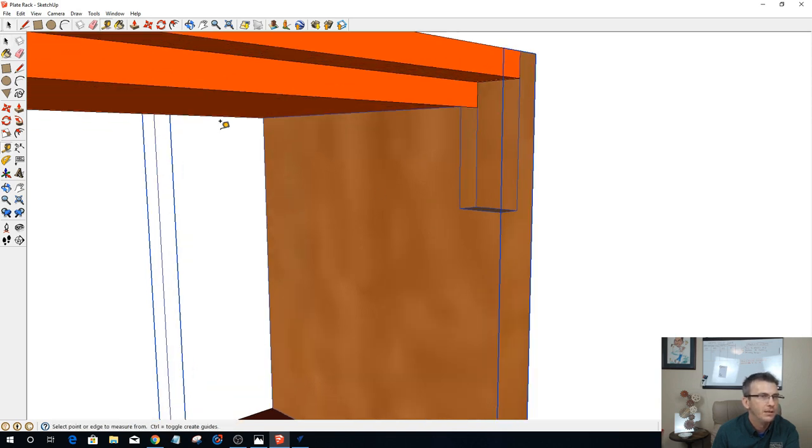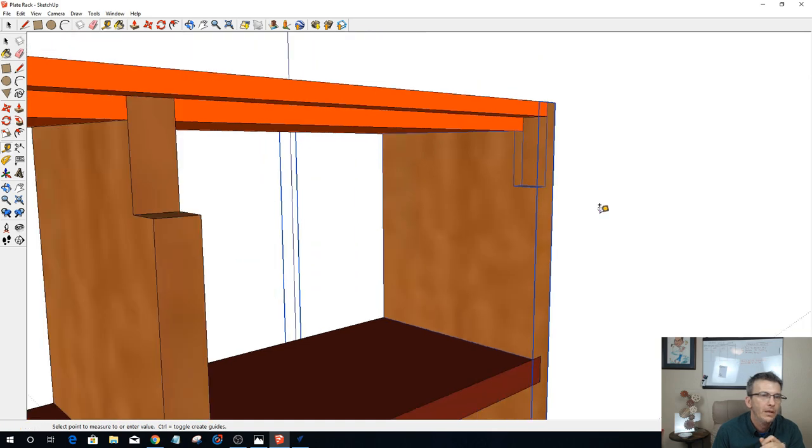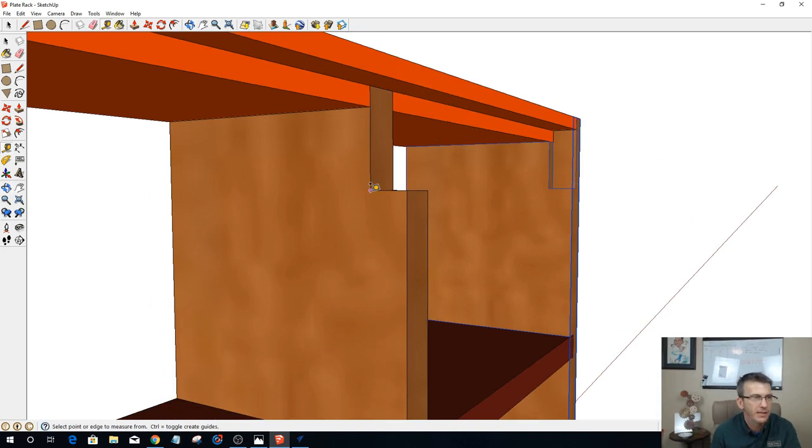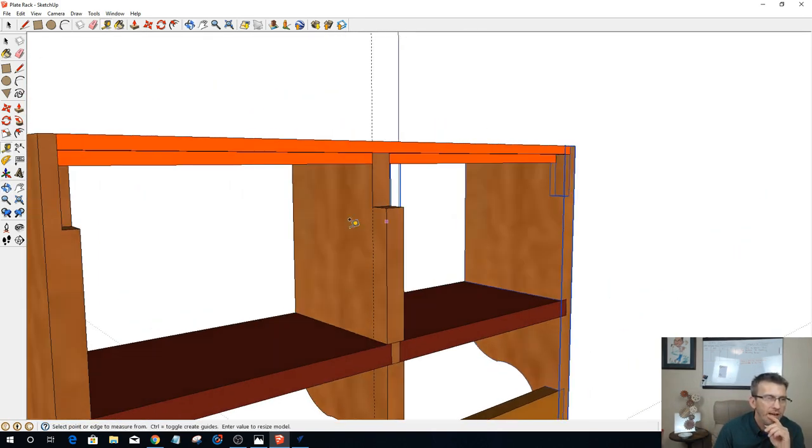We've got, let's see here, 3/4 inch in by 1.5. 3/4 by 1.5. Okay. All right, and then this one is the full 3/4 all the way up to, let's measure that, 1 7/8. 1.875. Okay, so one of our parts is going to have the rear notch taken out of the top, 1 7/8 by 3/4. We're going to notch that out with a dog bone fillet.